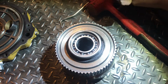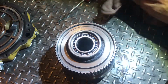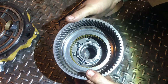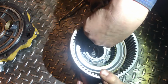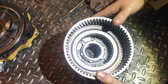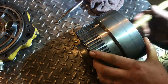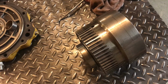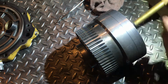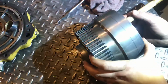I'm assuming that I put in too thick of a snap ring so it couldn't go in the groove. And could you grab the large brass punch, please? And hopefully, I think you can see the washer, the Belleville washer, whatever the hell it's called. It's not centered in its deal there. Could you, what are you after? I was just curious to look at the rest of the snap rings that we had. Oh, gotcha. There was a center one. Yeah, I forgot if that's what I put underneath or what. Could you grab the dead blow and we'll drive out this forward piston?